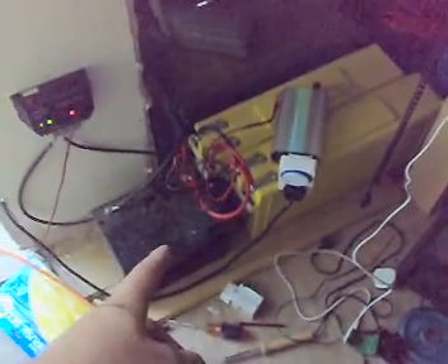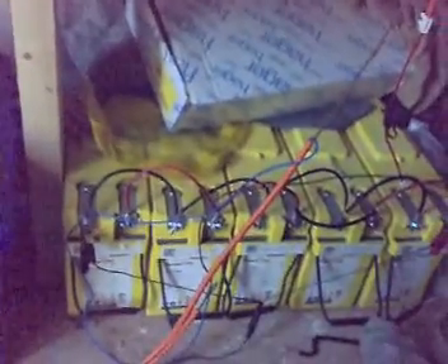With the two turbines and the solar panel, hopefully I'll have loads of energy. My idea is to use one battery bank for one day — like today, just use these batteries for all the lighting — and then the day after, once that one is fully charged, use the other ones. Then eventually if I can use a bit more, I'll probably use one for lighting and this one for something else, maybe TV, once everything is up and running.